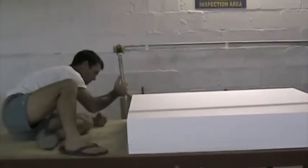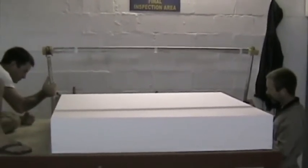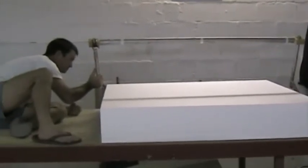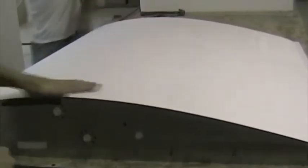6. 5. We're going to slow down a bit. Slow down about half now. Almost there. In the corner, pause. Pausing. And along the flat, halfway. Okay. And out. Down a bit behind. Yeah, just slow down a bit. There's a bit of undercut in there.